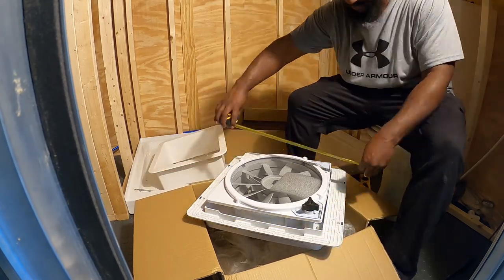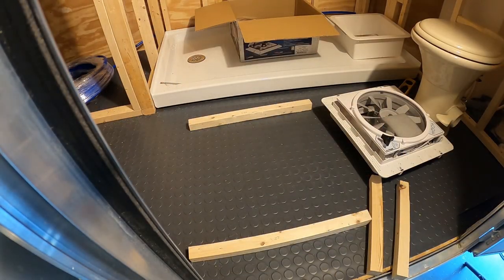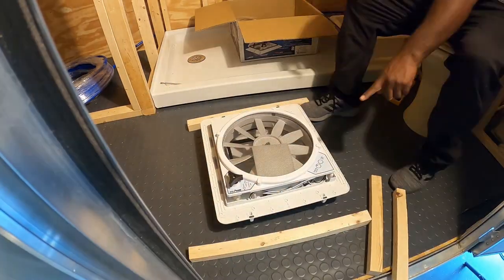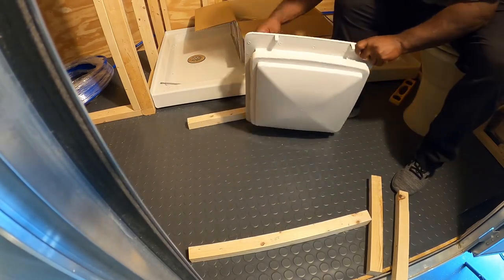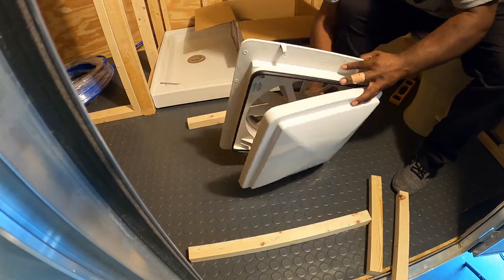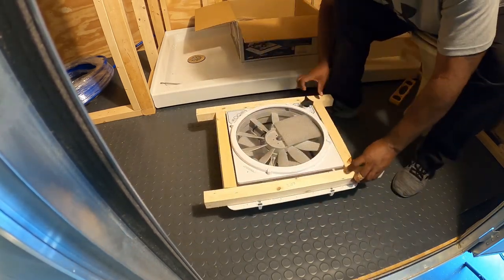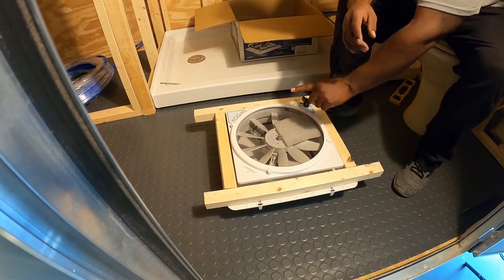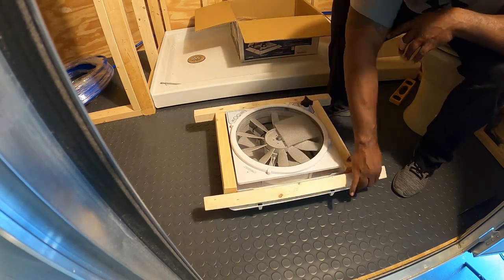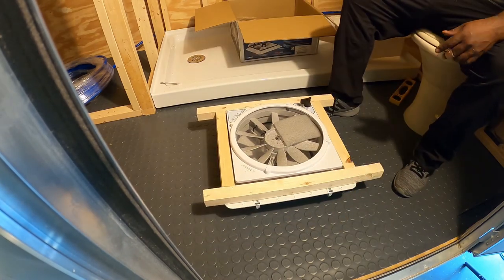I can post the model number in the description later, but I'm taking measurements along the side so I can go ahead and frame it out here with the 2x2s. I'm going to frame it out beforehand, then take that frame and screw it into the ceiling. I'm just making sure I get the orientation of the fan correct. It needs to sit with the opening up towards the rear of the trailer, so if it's open as you're driving, the wind isn't trying to tear off the cover of the vent.